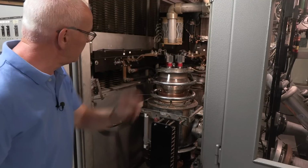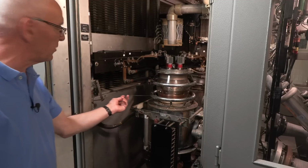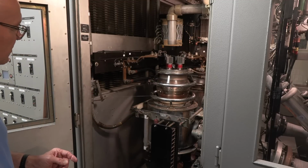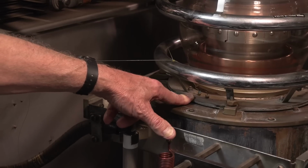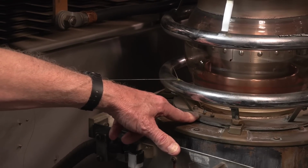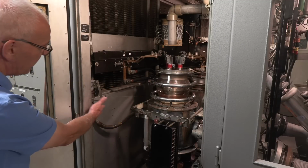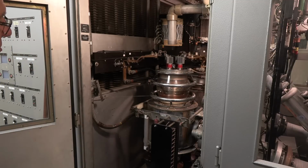Filament supplies here, and Bob spotted earlier this fishing line and asked me what it was. This is a heat fuse device, such that if the cooling ceases and this gets very hot, there's a 4BA brass bolt secured into the anode, soldered, with a hook on it. The solder melts, the spring here pulls the lever into position and breaks an interlock on a micro switch, and that will get the HT off the sender.